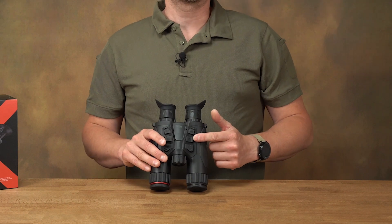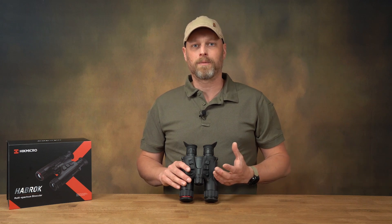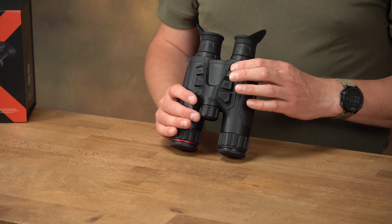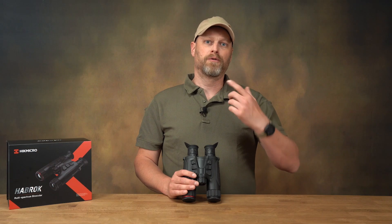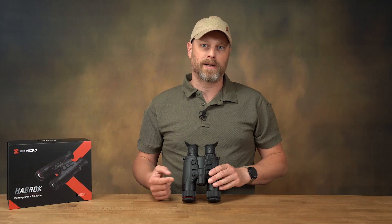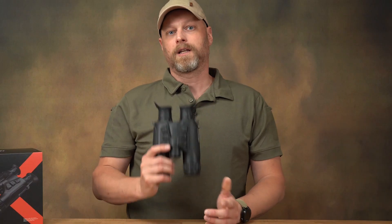The photo button is located in the middle on the left-hand side. A short press triggers a picture; a long press starts video recording, which also records an audio signal. The first button on the left-hand side facing you is for laser distance measurement. Pressing it triggers a measurement for 50 seconds. In the menu, I can also switch between single measurement and multiple measurements at a set interval.